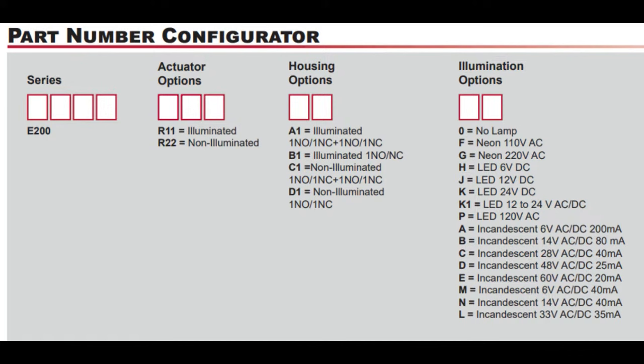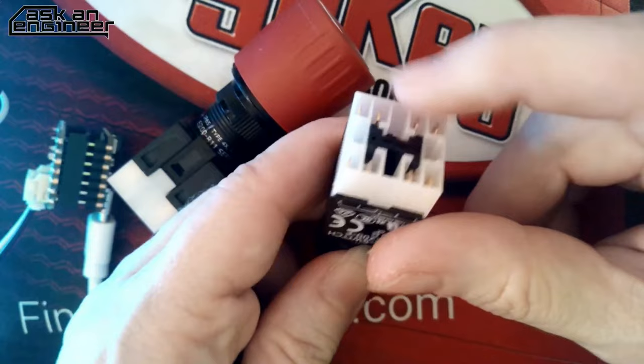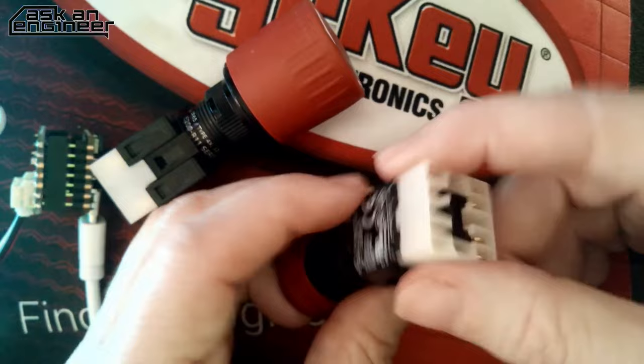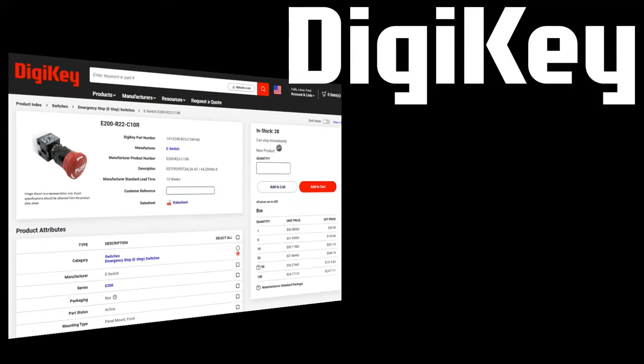You only want to put this at the very entrance of power - the inlet. You'll also need spade connectors. Another nice safety thing: on our low-cost switches the spade connectors are all exposed, but here they're completely covered - there's no way for them to accidentally get bent and touch, or for the spade contacts inside to accidentally short each other. You want spade connectors that have a full plastic cover, to minimize any risk of shorting between contacts, which would of course negate the benefit of having an eStop switch. It's available on Digi-Key, in stock.